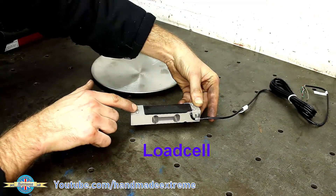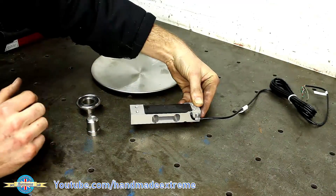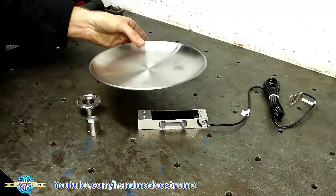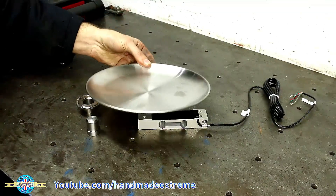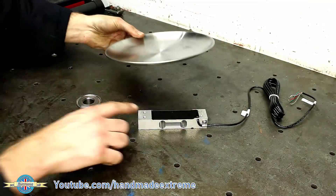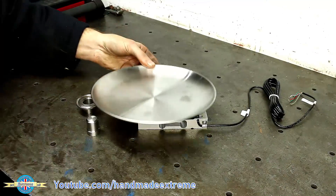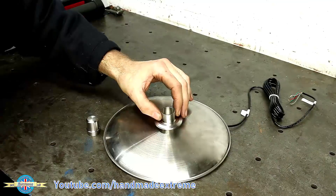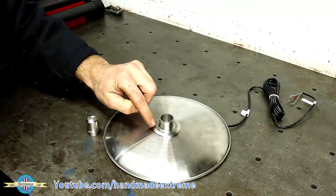What they'd like to do is have this plate here on a little fitting, sat on this end of the strain gauge, and have it so it's removable so they can clean it. We're going to put a tri-clamp fitting on the end and weld it on — that will give us a nice little boss with a hole in it.